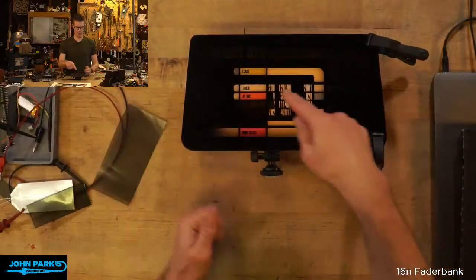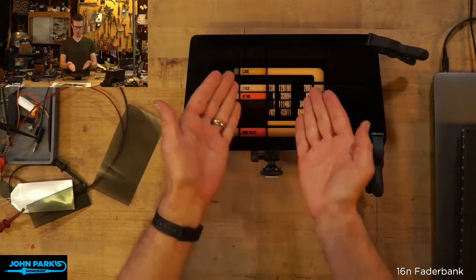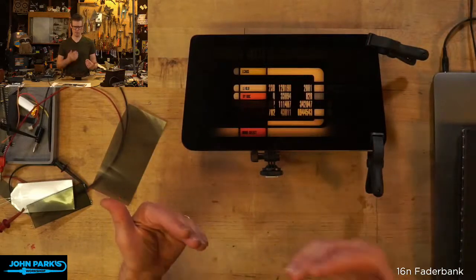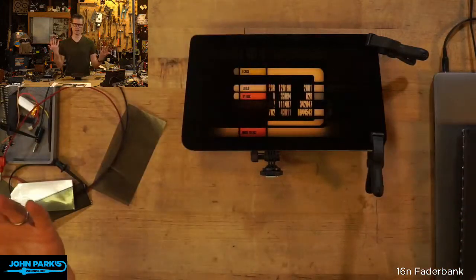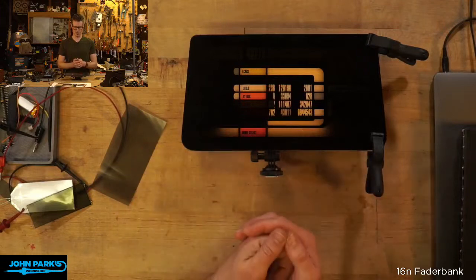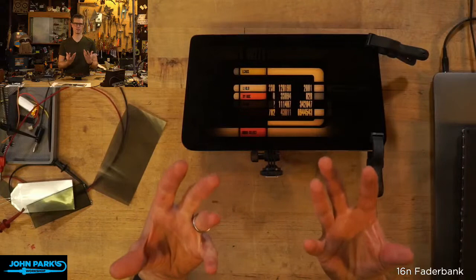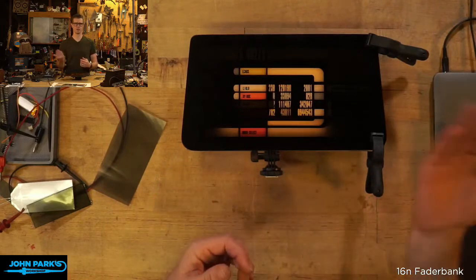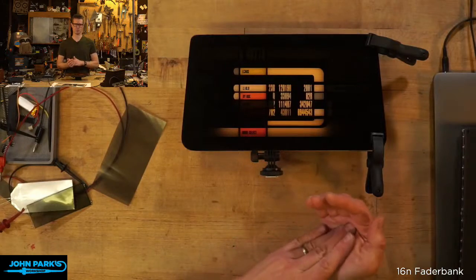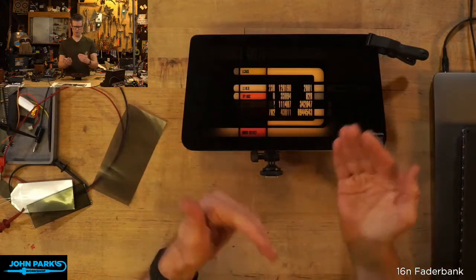I may be able to not only animate things in blocks, but also pick up their colors, use a matching color, which will also help. So this just requires white light coming through, but there's a chance that if I also do some color matching, I'll get an interesting effect and use less current than pure white, because pure white on those matrix panels uses RGB, so you've got like 60 milliamps per LED, and I got a heck of a lot of them with 64 by 64. So those are all some considerations.